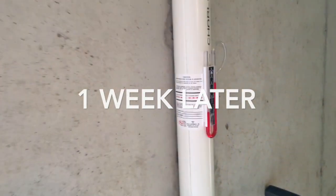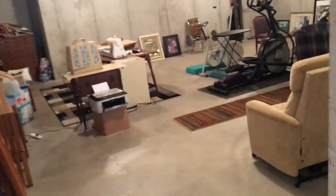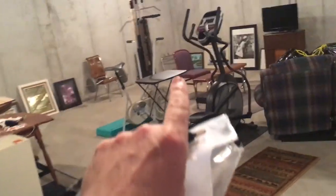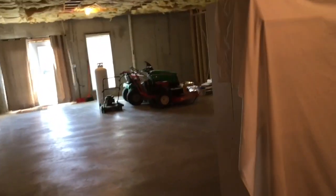The system is activated and the test came back — both sides were hunky-dory after the fan test. What I was really concerned about was a footer right here blocking communication between this part of the house and this part of the house. Believe it or not, the radon levels in this part of the house actually came back lower than over here where the source is. I have no rhyme or reason why — I'm just glad it did, because not all surprises are pleasant in this business.